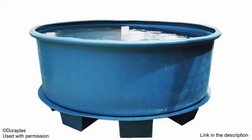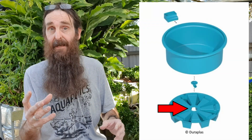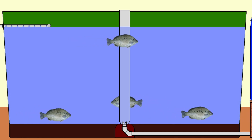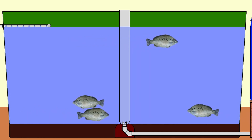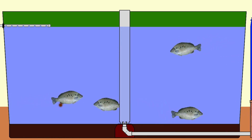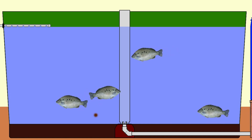You can also buy stock tanks and purpose-built aquaculture tanks made from HDPE or fiberglass if your budget stretches that far. Some of the smaller 1,000 to 3,000 litre, or roughly 270 to 790 gallon, tanks can also be supplied with a base. These bases have little cutouts which allow you to attach a drain fitting to the center of the base of the tank. Because there is a drain in the base we can plumb these up a little bit differently — the swirling motion of the water drags the solids into the center, and we can have a solids lifting outlet situated there to take advantage of that.